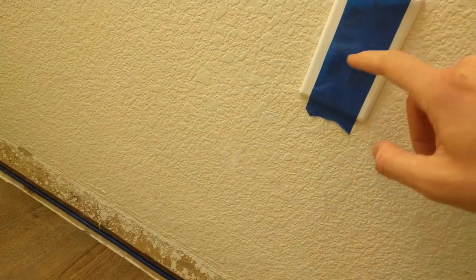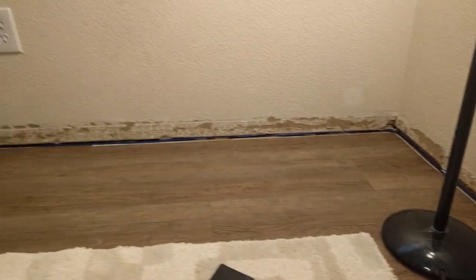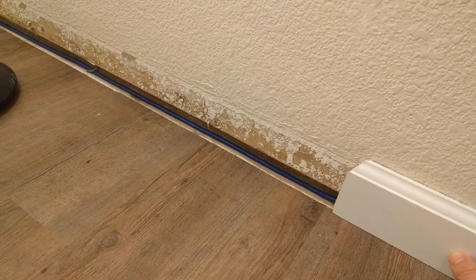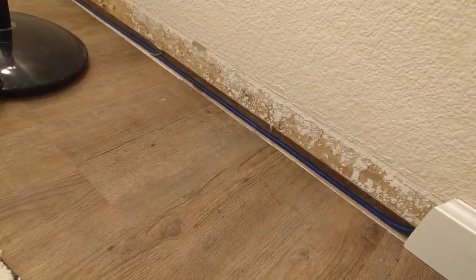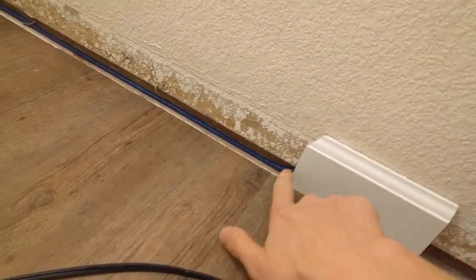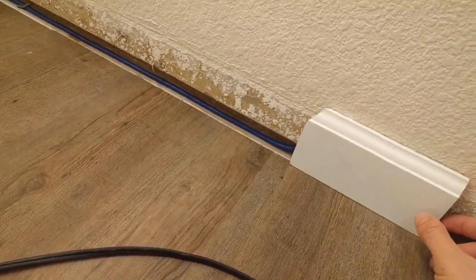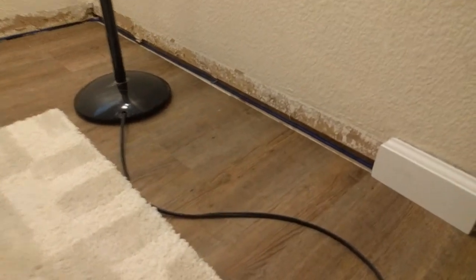The ethernet will just continue - it'll be accessible here, zip-tied to that USB, and then go down and all the way around underneath, next to the sill plate underneath the baseboard. It actually fits pretty well - there's plenty of space. I've heard of people putting wiring behind their baseboard and it works really well; you can't see it at all. The main thing I need to do is mark where not to nail, because you typically nail into the sill plate along the top to hold the baseboard, and you don't want to nail onto the wire and damage it. I'll just put a pencil mark saying don't nail here, then put the baseboard in.